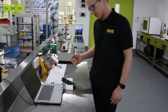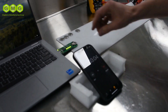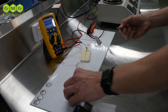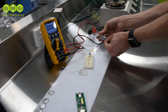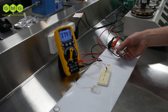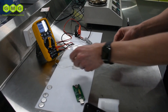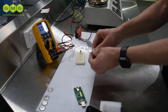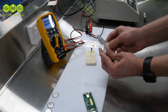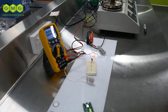So that's come up on two minutes now of charging. We'll stop the timer and have a look at what the voltage is up to now. That gives us 3.74 volts after two minutes of charging. And just to show that the cells are alive, we'll put them into this 2032 holder. And there are our charging 3 LEDs.